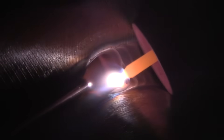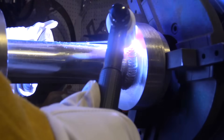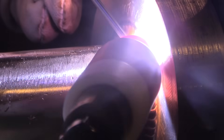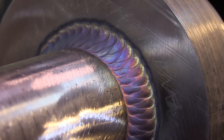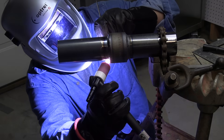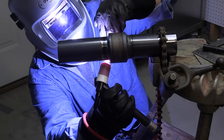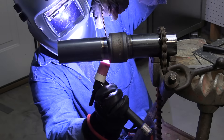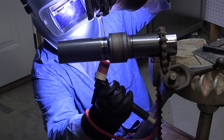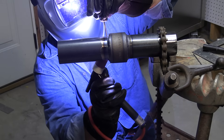I've got a few more clips of similar walking the cup stuff to show you. I'll try to link up a stainless steel multiple-pass fillet weld video I did showing arc shots and walking the cup — I put several passes on there, like you sometimes have to do on a double extra heavy wall thickness socket weld or slip-on flange. And coming very soon, I'll do one in a tripod vise going from bottom to top, because that's what you have to do a lot of times when you're welding a tie-in joint or you've got an offset that's just too long to flip. Some tips for that coming soon.